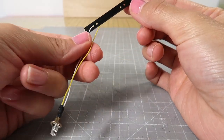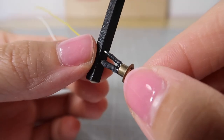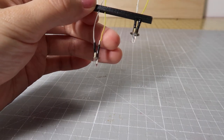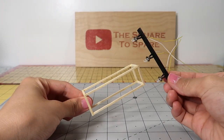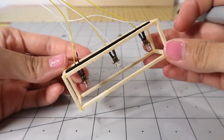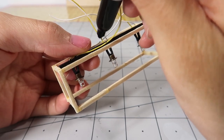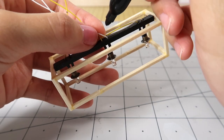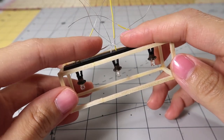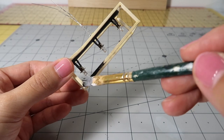Take a bulb and thread the wires through a set of holes. I use a bit of epoxy to hold them in place. Once all three are in, move this bar to the center of the top rectangle. Let's make the wires look a bit cleaner. I fold the side wires toward the center and mark where they meet the center bulb wires. Snip the plastic above that marking. You'll connect all the white wires together and all the yellow wires together. Here are the two bundles.